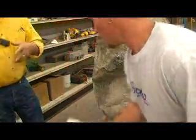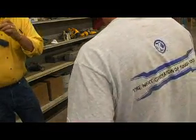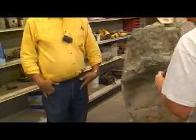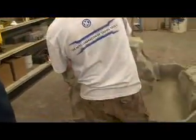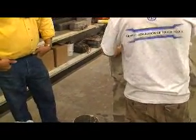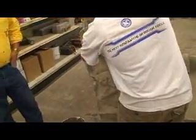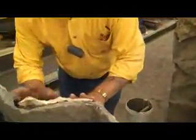Now on top, this is where you go into a more... What do you call it? A quarter, a half. If you're going 1.5 inches, 2 inches, you've got a whole different story there. Believe it or not, when we stamp, there's a window. You can't go from a quarter inch up to, I would say, 1.5 inches, but the edges taper out. Right, they're going to 0, but you're not going to have a problem with it. Now you're treating that like all one. He's got the mud there. He's just mudding it all.